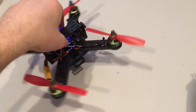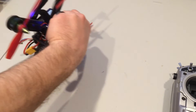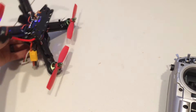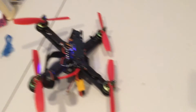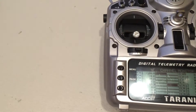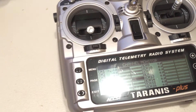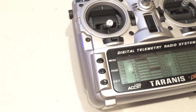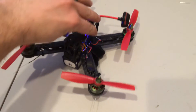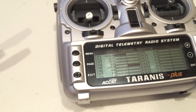It all depends on your antenna orientation. What you've got to do is, for each craft, take your antennas and play with them to figure out exactly what's going to give you the best signal. Maybe you want to test it upside down or on this edge and see what you get. By putting it through that 4mm carbon on either side and coming out the arms, I'm getting a whole lot better signal. This is all bench tests — I was not expecting to be hitting the 30s and 40s as I was. Coming through that little hole right away made all the difference in getting amazing signal strength.